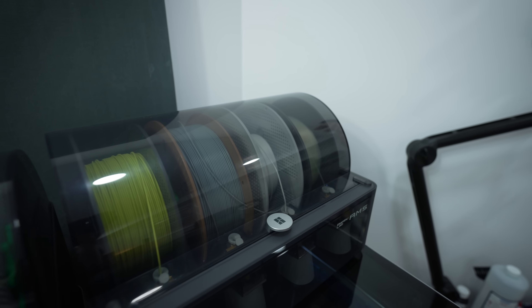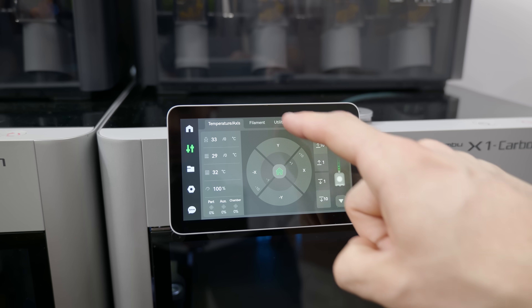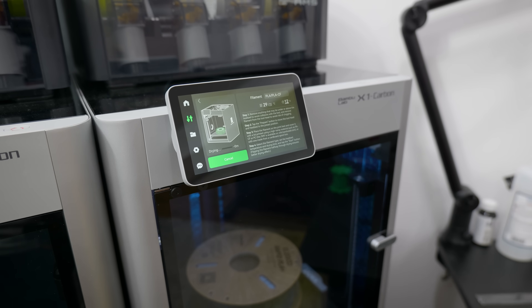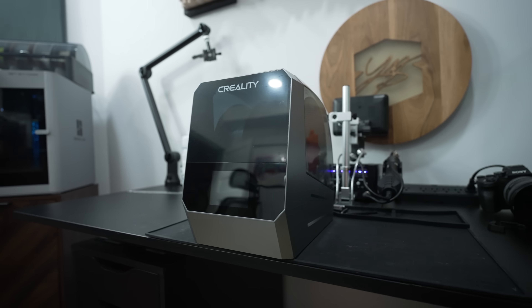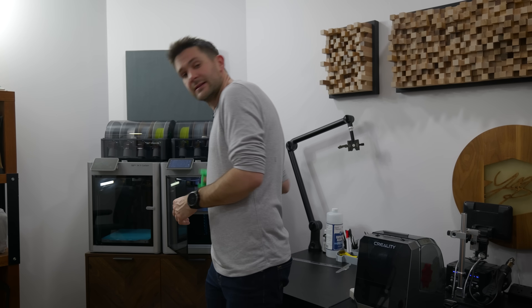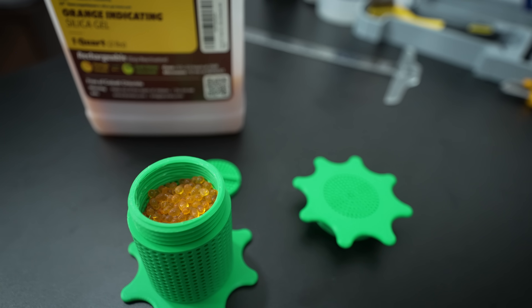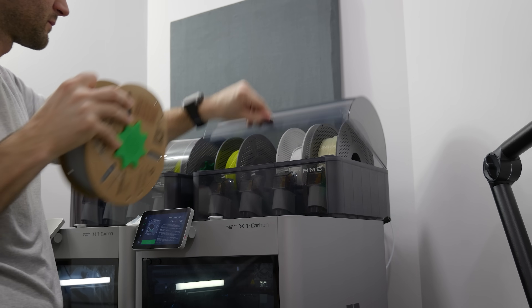What is the biggest enemy of filament? Moisture. If you're ever having problems with your prints, your first troubleshooting step should almost always be drying out your filament — and no, your filament isn't dry just because it's a fresh roll. Many filaments come from the factory pretty damp. If your printer is anything like mine it has a built-in drying setting that uses the bed heater, or you can invest in an external filament dryer. But once you dry your filament, it's going to immediately start absorbing moisture again. So I like to print these little desiccant holders that go inside all of my spools. These orange silica gel balls love to soak up moisture, and if placed in a sealed enclosure with your filament — like the AMS or a spool holder — they will keep your filament nice and dry.